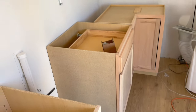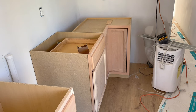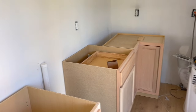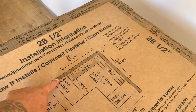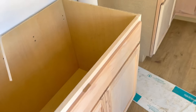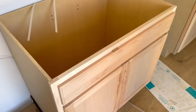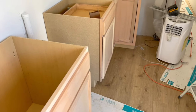It's going to be a lot easier for me to paint these cabinets on the wall than to pick these 50 to 100 pound cabinets up by myself and take them outside. What you need to know about the lazy Susans is they don't come fit to size — you'll have to add a nailer or a block. This Susan says it's a 36-inch but for 24-inch depth cabinets the actual measurement is 28 and a half. I called a buddy who does a lot of cabinets. I've hung a few cabinets before but this is the first time doing it by myself and installing Susans.